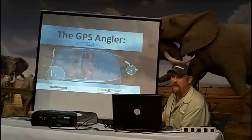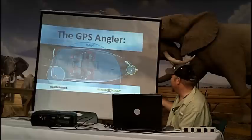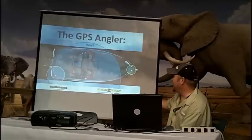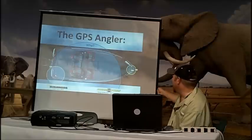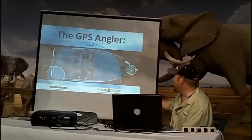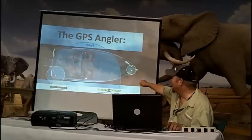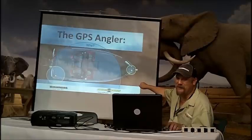Now, some people say they only want one receiver. Some guys will just put it here. If the boat's traveling here, they're using this one. You know this distance, and you're creating that waypoint. The precision is getting back on it here. This relationship — you're typically, if you're going to come back to the waypoint, probably going to be on the trolling motor if you find a brush pile with fish. The most critical thing, in your example, understanding this — you could add seven, eight feet maybe. The big thing is your boat spins around the circle of the transducer. The waypoint in the same spot — the transducer could be in that big circle and still be at that exact same waypoint location.